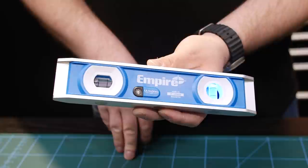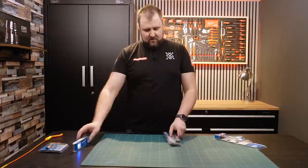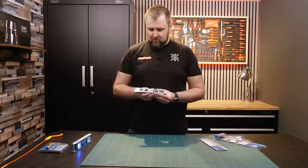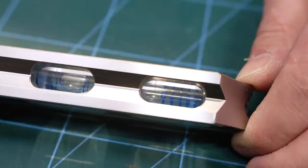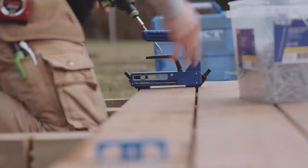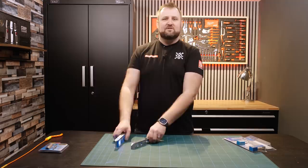I've not seen this brand Empire before in the UK, but it is quite a big brand in the States. This one is just your traditional torpedo level, but it does feel quality. This other one is like your full milled aluminium body level — no lights, but it's a thing of beauty with the True Blue Bubbles and different angles too — your typical 90 degree, 45 degree. Then this one is called VariPitch — you've got markings showing an eighth, quarter, three-eighths, half an inch out of level, which is perfect for decking or guttering that needs a slight incline. That is number eight on our list — the Empire Levels.